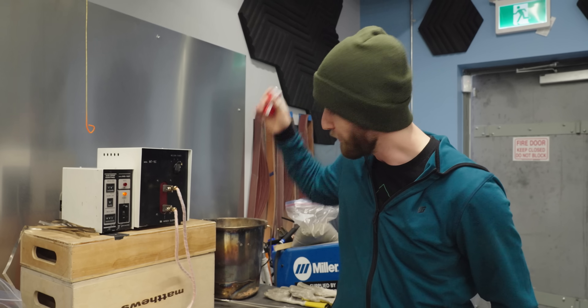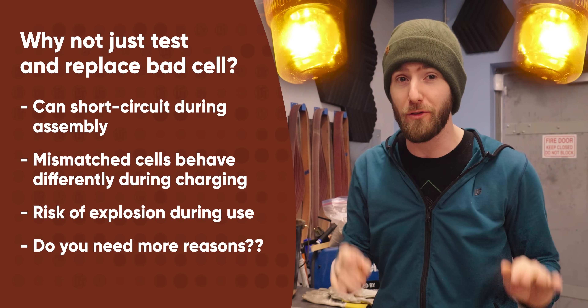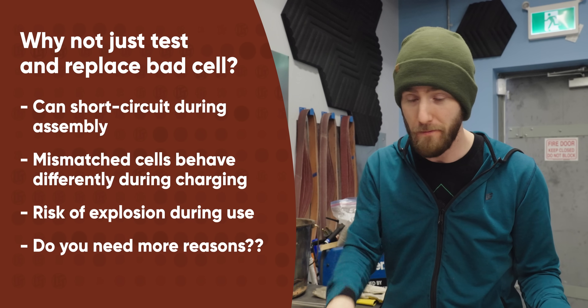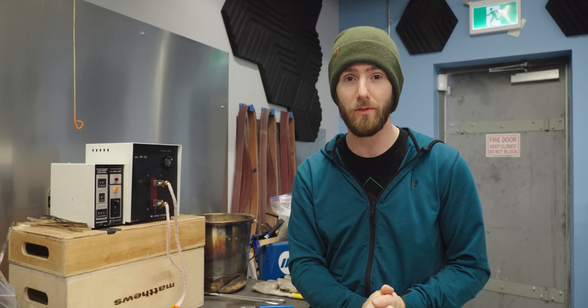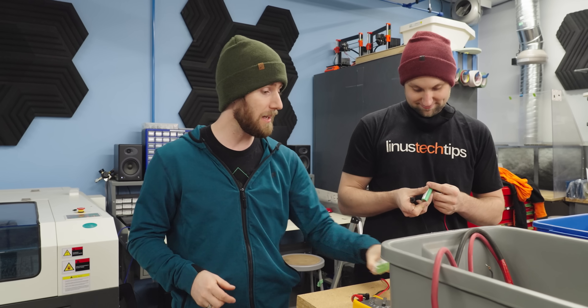You might be thinking that pack probably only has one or two bad cells — why not just swap those out with good ones? No. We never do that. There are lots of electrical engineering reasons not to. All new cells. Getting your hands on new cells isn't always simple, and you need to do your due diligence to ensure you're getting genuine cells rather than counterfeits, which can have issues with reliability, capacity, and safety. We picked these up from a local vape shop we have enough of a relationship with to trust.